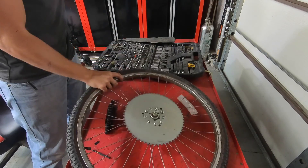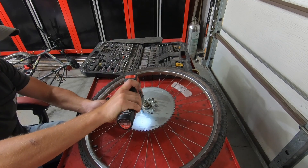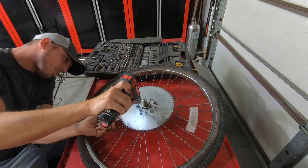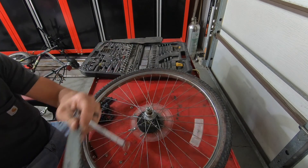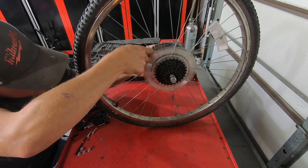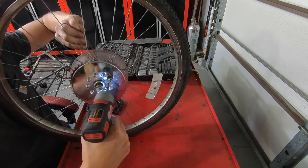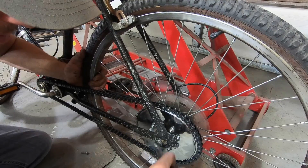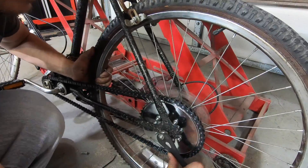After I shifted the drill into second gear and tried to see how fast it could go, it kept cutting out. It would stay engaged for a few seconds and the bike would go pretty fast, but it wouldn't stay engaged. There's like a sensor in the drill that once it's pushed to a certain point, it trips and you have to let off the throttle and re-engage — really annoying. Speed one on the drill has plenty of torque and doesn't kick off at all. So I'm going to take the 60-tooth sprocket off, put a 44-tooth sprocket on the rear, and see what it will do in speed one to bring up that top speed.